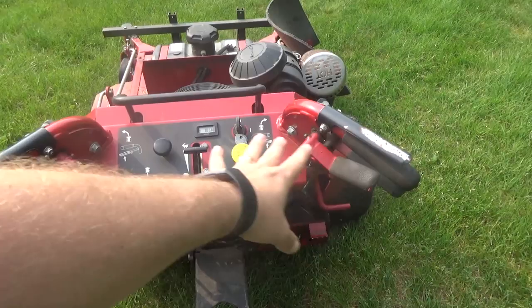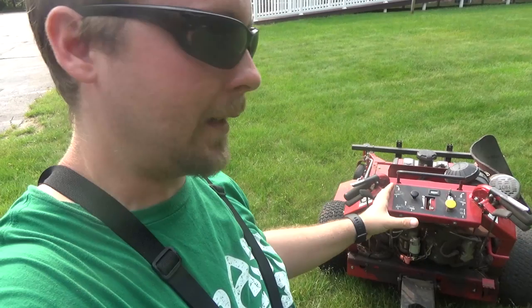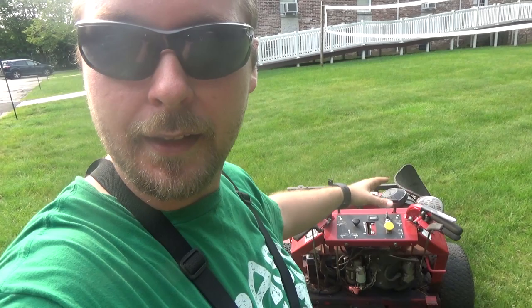And so this is where it gets a little tricky because, for instance, if you live near any kind of thorny bushes like rose bushes or blackberries or anything like that, if one catches you while you're mowing, and this has happened to me and this has happened to a buddy of mine, your instinct is to reach for it. And what happens is, you let go of one of those handles while it's going forward, it's gonna swing because now you're not slowing that end down and you're slowing the other end down, and bad things can happen.